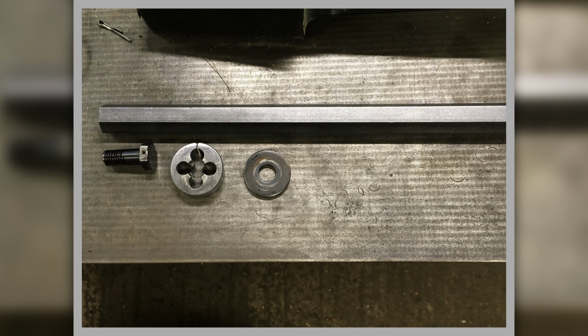Right, to hold the fan on, you have a left-hand threaded bolt. I think I called it a nut in one of the videos before, but anyway, it's a bolt. And so it does up counterclockwise, as it were. And the idea is so it doesn't unwind itself when the engine's running. And we were missing it.